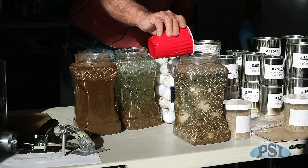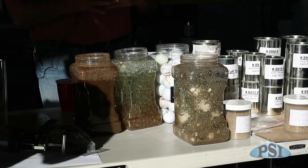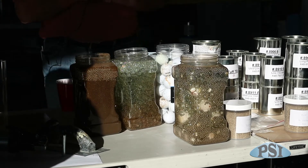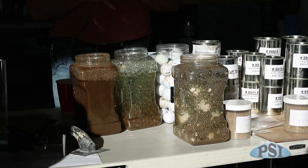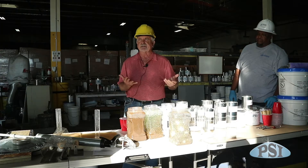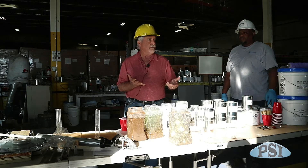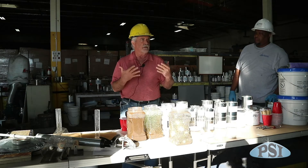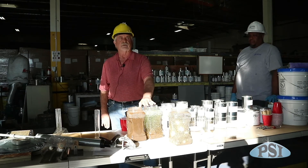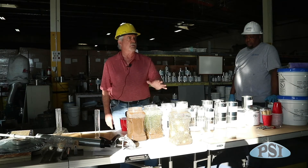We've had a dramatic decrease in the amount of resin demand as your binder. This is just a perfect picture to show what we did with the aggregates that we brought in from Texas and the aggregates that naturally occur in Southern California. We took those and we blended them. We can reduce the resin demand by 16%. Usually the most expensive part of a job is the resins rather than the rocks. But for the most part, we're using relatively inexpensive silica sand. That inexpensive silica sand — you'll increase the sand, decrease the resin. And that's really what we're trying to show you today.